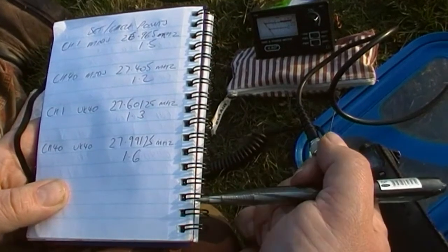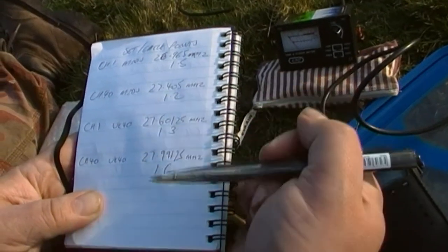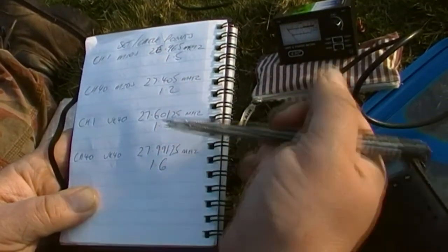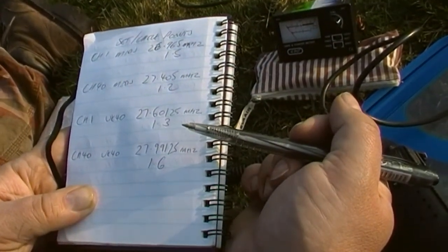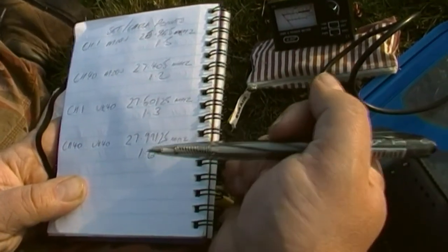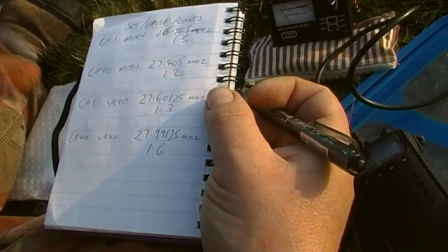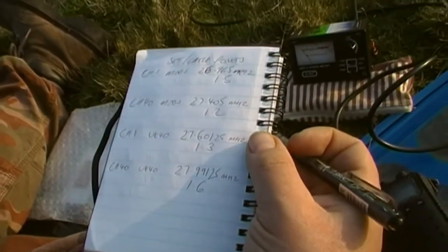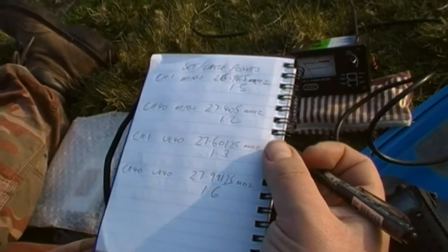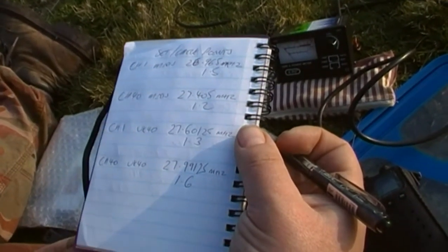The top half — the exposed dielectric — is the same length as the bottom half down to the choke, which is great. If you find that you're folding over a lot of cable and the top half is nothing like 102 inches — because I've seen some people folding over a couple of feet to get the SWR down — revisit your choke or revisit your construction. There's a good chance you're going to tune it out of resonance, and that will affect performance. Really the top half and the bottom half should be the same length. If it's a little bit different, so be it, but if it's way off, you've probably tuned your antenna out of resonance just to get a good SWR.